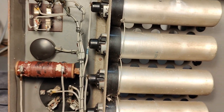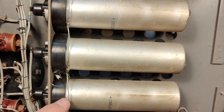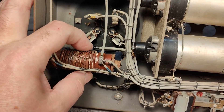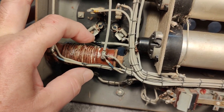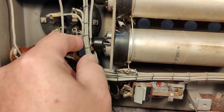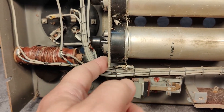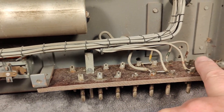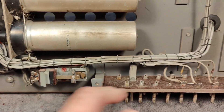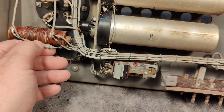I still haven't really figured out what it is doing. Is there a way we can figure this out? The capacitors are in two-and-two parallel, but all four grounds are together, so it's a rather simple circuit — I should probably be able to figure this out. And then this resistor right here is broken. It is melted like that, and when it looks like this it's typical of overloading. So I can follow the color-coded wires: this one is blue, this one is blue, this one is red — probably going to the red component. And a brown one goes to this resistor. I still don't understand exactly what the transformers are doing or how they're connected.